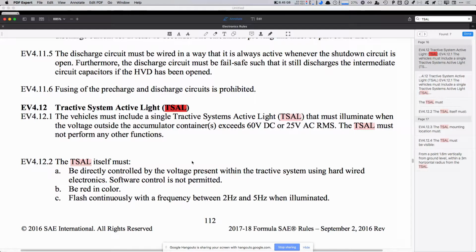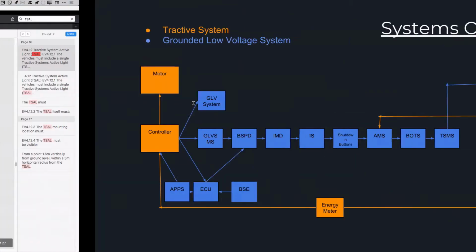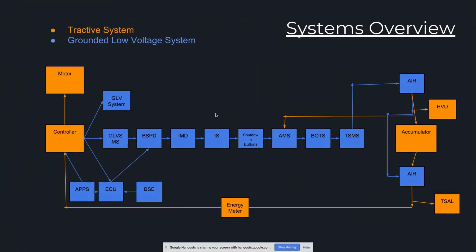The parasitic drainage of powering it off the low voltage wasn't the issue as long as you have a high enough impedance limiting the amount of current that's draining into that light. If you're draining too much current, you'll see it and it'll heat up way too much. But it was just having those two lines out there, or having that node in the design, which wasn't ideal. Anyway, that's good for that.